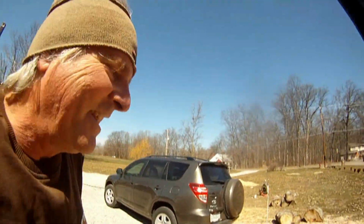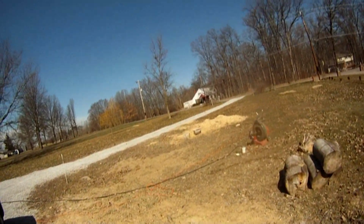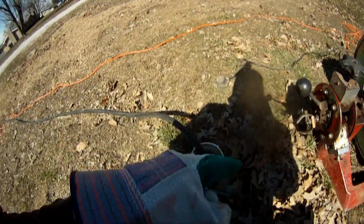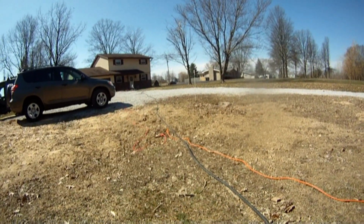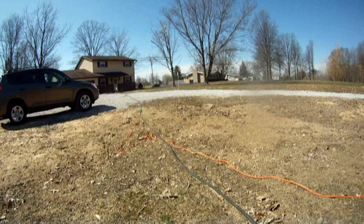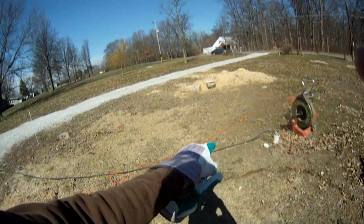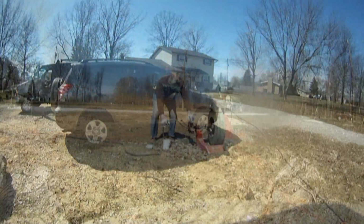Alright, we're here at the job site and we're going to go ahead and start doing some drain tile cleans, mapping, and just making sure that the line is totally clear. We use cutter blades on the end of the cable. That way when it goes down through there and gets over there by those trees, there's roots over that way. And we want to be sure that we clear this line because it takes an awful lot of water. This whole area is gravel perforated pipe, and it all connects into a solid line going down here and out around to the back side of this home.